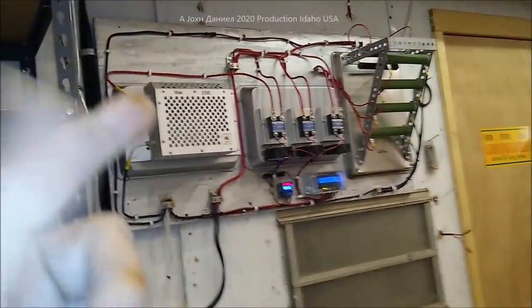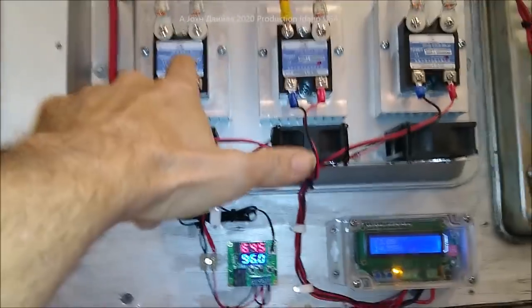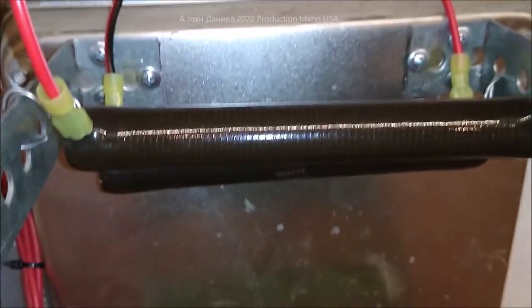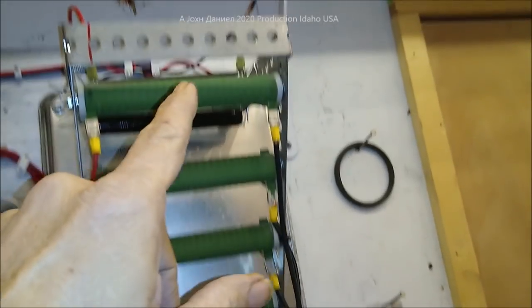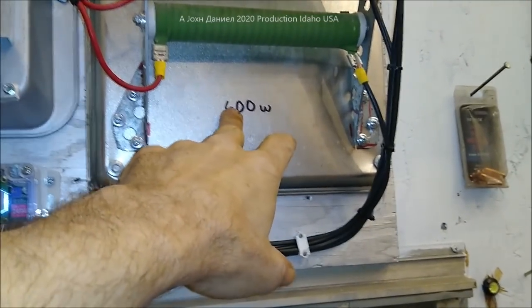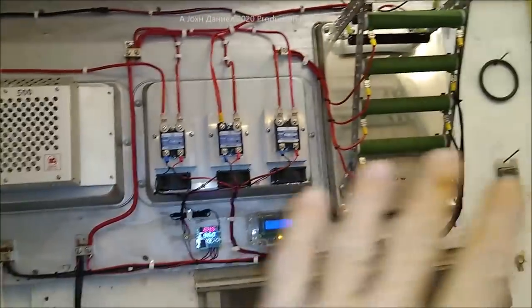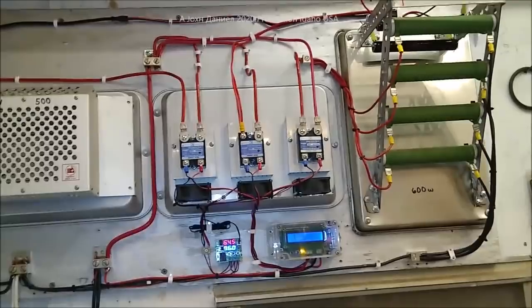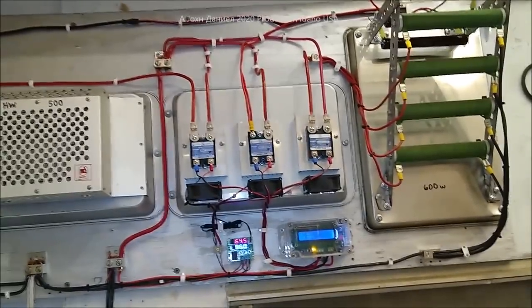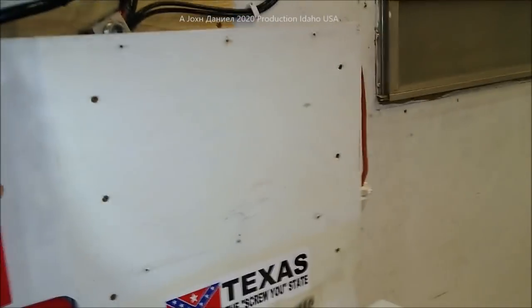My system up here is 500 watts, 60 amp, 40 amp, 300 watts of Ohmite, 150 a piece. Down here I have 100 watts each. We are running at — I think it is like 800 watts total here, 1300 watts of diversion. So I have 1300 watts, which is the equivalent of about 95 amps. I can knock 95 amps out of my system with a quickness.